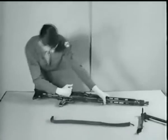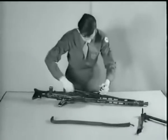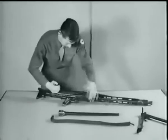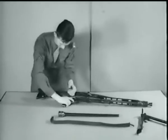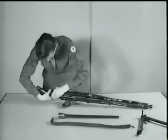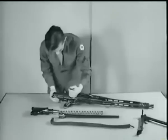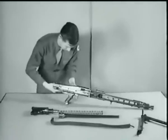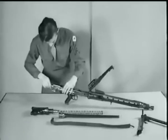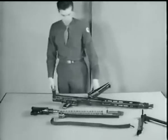To change the barrel, a barrel change lever hinged on the right side of the barrel jacket is provided. The lever swings out, bringing the barrel with it. Slide the barrel to the rear and remove. Then the butt comes off, followed by the driving spring. The cocking handle is pulled to the rear and the bolt comes out. This completes the disassembly.